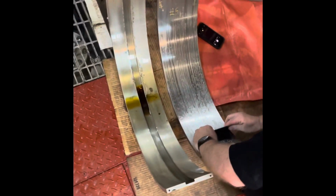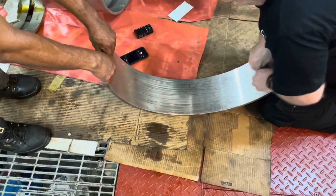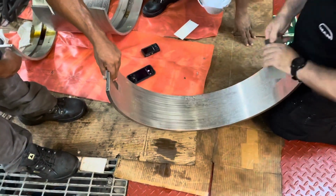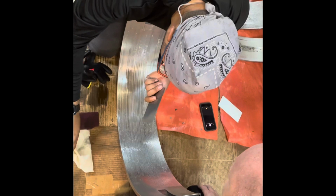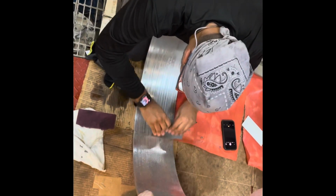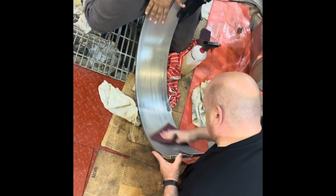This is a bearing scraper. Here you can see the B&W service engineer repairing my crankpin bearing using the bearing scraper. Basically, he was trying to make the bearing surface as smooth as possible. Once scraping was finished, you clean the bearing surface using a Scotch-Brite. This is a steel ruler. Using this, the service engineer checks the bearing surface for any unevenness.